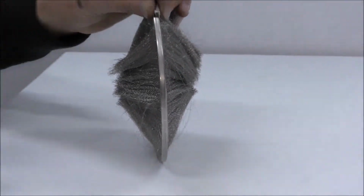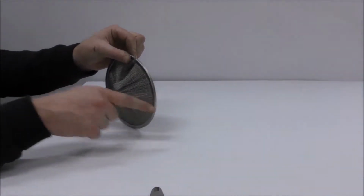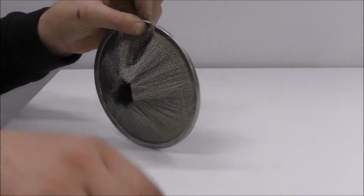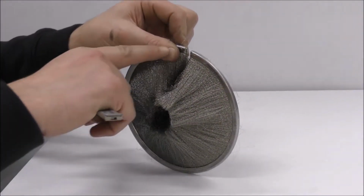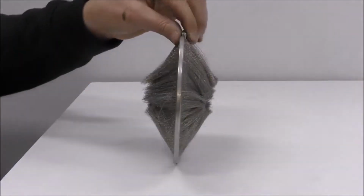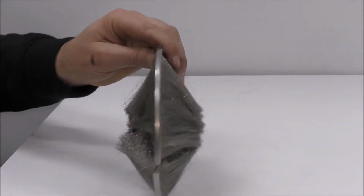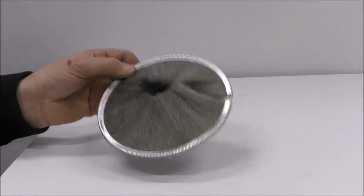So we've got 5mm stainless strip wound with internal bristles at 160mm diameter, with, rather than stipulating the inside diameter, we'll confirm the trim length. So 5mm strip brush, 65mm trim length, wound to 160mm diameter, one single coil, which is your internal coil custom design there.